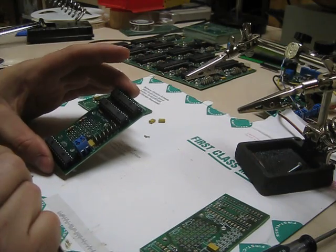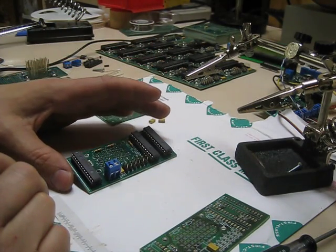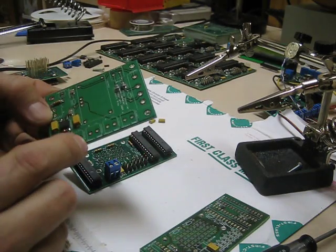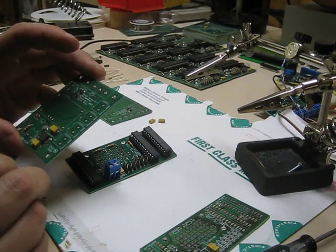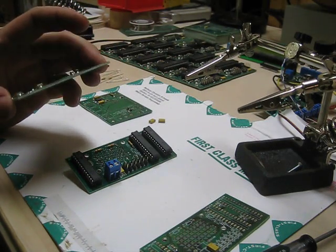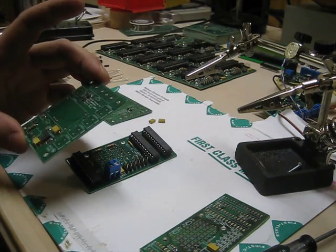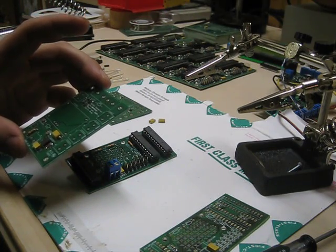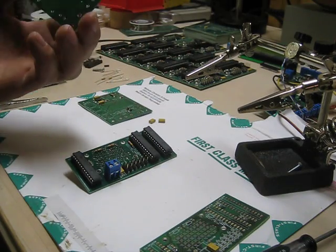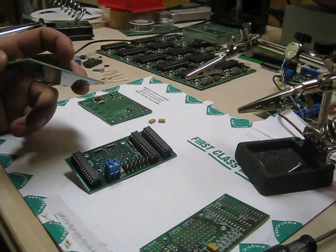Make sure you're giving it 5 volts, hooked up properly — negative and positive are clearly marked on the board. Most of the kits I've sent out come with a DC to DC converter. I use a power supply from an old computer — take one of the black wires, which is ground, and wire it to one of the green wires, which turns the power supply on. You're getting 5 volts and 12 volts out of the leads. Shorting the green to the black wire acts like an on-off switch. I put the 12 volts into the DC to DC converter, which converts it to 5 volts, and it goes to the display and works just fine.